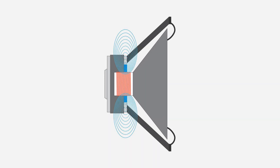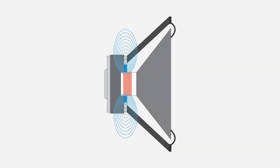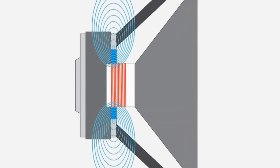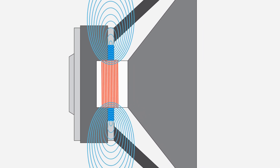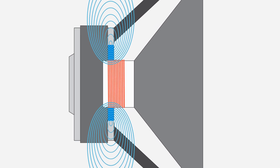So in order to get a similar effect, speaker designers sometimes will make the voice coil shorter but larger in diameter, and the magnet structure may be a little bit longer. This is called an underhung voice coil, because it does not hang over the area of the most focused magnetic force. On an underhung voice coil, as the coil moves the cone through larger excursions, we can see that the coil is still almost completely under the control of the most focused area of magnetic force.